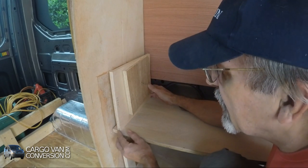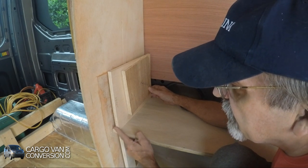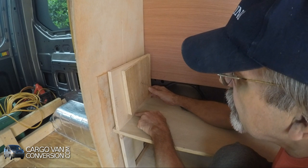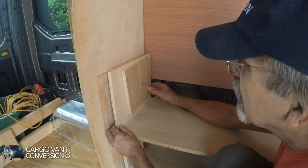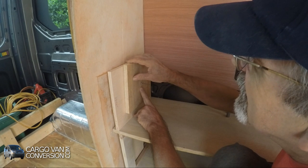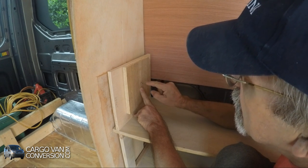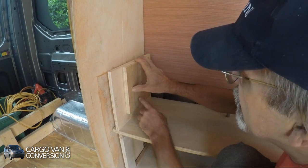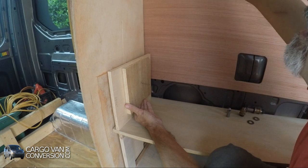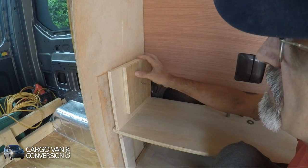Made this little jig. This is the front and the bottom. So I placed the front at the front of the cabinets without the doors. So you know exactly at this point, use the little drill bit as a pivot. So you know exactly that the pivot point will be located at this point if everything's fine. As this is the vertical part of the bed, it goes up and down. This is the bottom of that bed, or the side, whatever you want to call it.